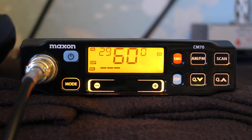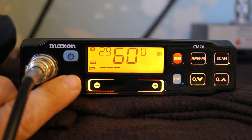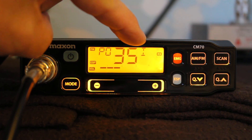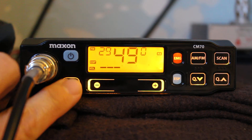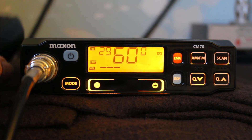You can see the display has changed. Last time I had it in this mode I had the frequency counter on — you can switch between channels and frequency counter by pressing and holding the mode button. What you see there is PO, the country mode, and it's on channel 35, band I. As you go up the channels it goes up to 40 and then down to band L on channel one — a bit like an old-fashioned CB radio with a big band switch. For our purposes we want the frequency counter, and you can see that's 29.54 to 29.6 megahertz, and it is transmitting on there with no problem at all.